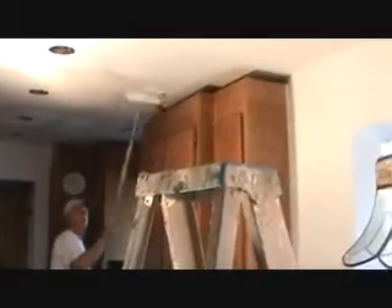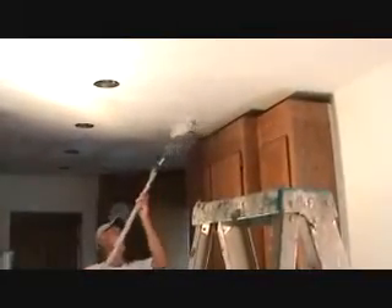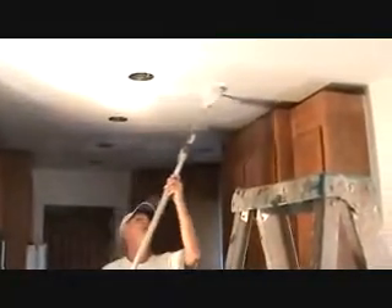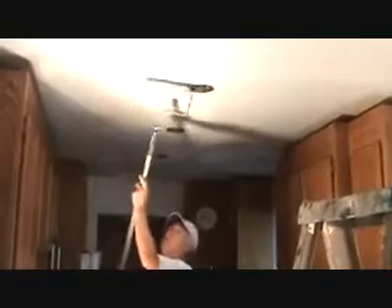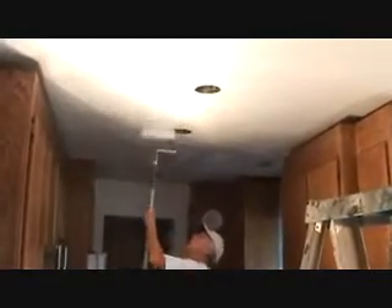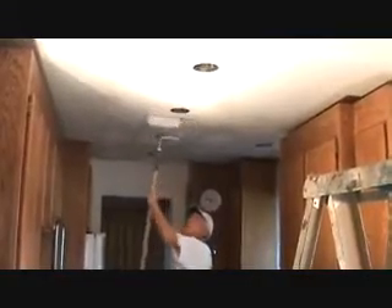You're not going to have to cut that in per se, because they're going to end up putting crown molding on there. But I'll roll my thinner roller and roll it back in there to seal it. With the smaller roller, because this thick nap won't go behind on the cabinet top from where the cabinets meet down from the ceiling. I'll probably hit the cabinet, so I'll just roll with the mini roller in there and get as far back as I can reach to seal it off.